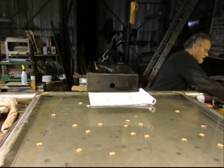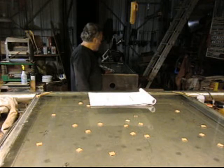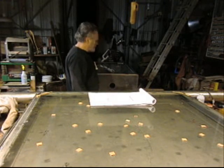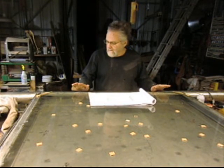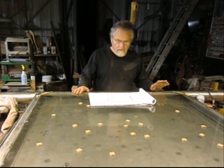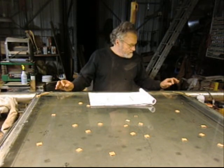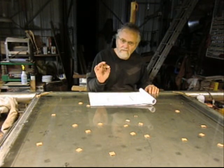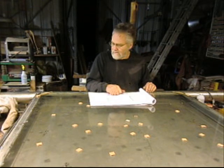All right, so we got the glass in. We got everything all set up here. Well, not totally set up. I still have to put the screws in and get the glass mounted, and we put the hinges in and the locks. And then we started on the glass on the sign. And I think it's going to work out just fine. The glass is a little bit big for the frame. We got to cut the frames and re-weld them up. Just a slightly bit larger, like an eighth of an inch. So it's, you know, not too much of a big deal. It's going to take some time.